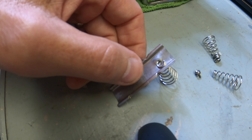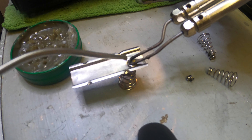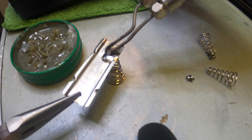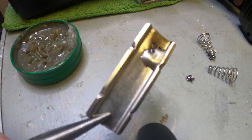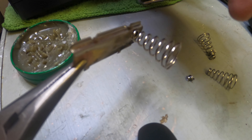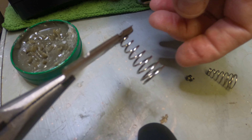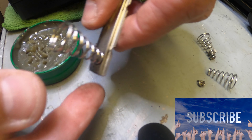I'm just going to solder this right down here. Let's get some flux and get the soldering gun going. This took a few minutes because I kept on losing my hold on it, so make sure you use a tool — it's going to get really hot. I used a pair of needle nose pliers to hold it and a real beefy soldering gun, and that worked really, really well. And that is in there — that is soldered, that ain't going anywhere. That's a good connection.